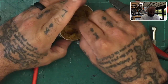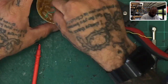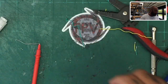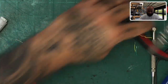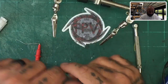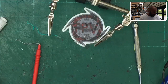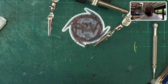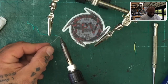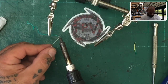I'm going to use the flux paste and dip the wire in it — I find it tins a lot better this way. I'm using a helping-hands holder now because I've got students from local junior highs doing drone programs watching, so I want to show them the proper method. Just place your wire in there so it's held safely and go ahead and tin it quickly.